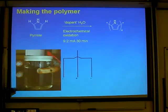This black thing in the middle is the polypyrrole growing. We have two negative electrodes. If you just have a single positive and negative electrode, you get a film on both sides of the positive electrode, but one side is really thick and the other side is really thin. By putting two electrodes in, you get an even film on both sides. And bearing in mind we're dealing with first-year students, this gives us a chance that if they mess up taking the film off, we've got another film. So it's nice, easy, and simple — that was a key thing. We didn't want anything that was really complicated or really hard for them to do.